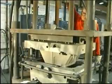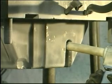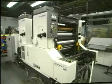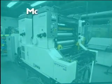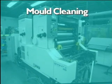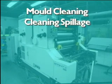As we have seen, dry ice blasting is a safe, effective, non-abrasive cleaning tool. It is chemically inert and does not involve the use of solvents. In addition, most commercially available dry ice is approved for food use, and because the process damages and removes microorganisms, it leaves surfaces safe for direct food contact. Some of the most typical uses of dry ice blasting are mold cleaning in the metal casting, plastics, and rubber industries, and cleaning spillage or end-of-run leftovers from process machinery.